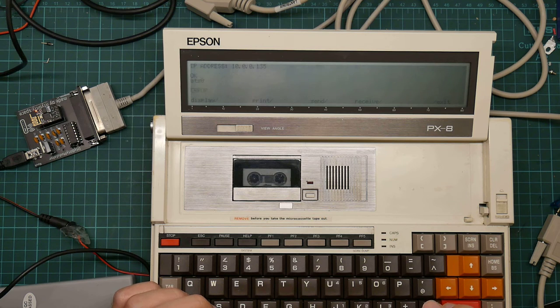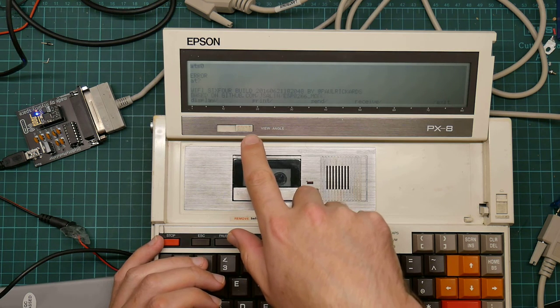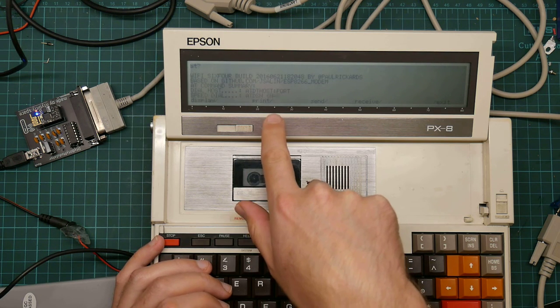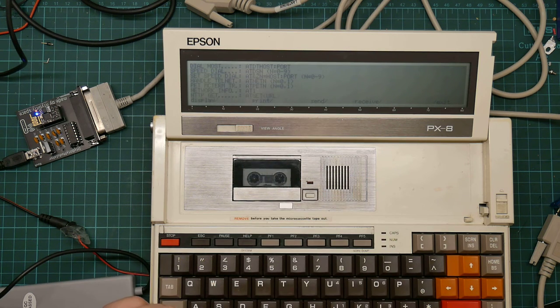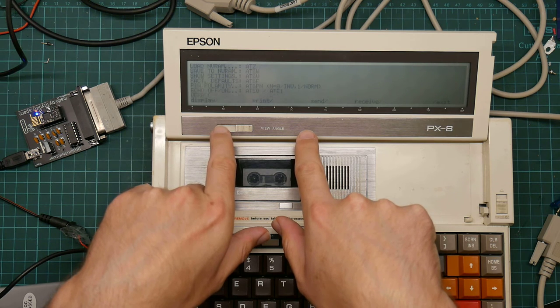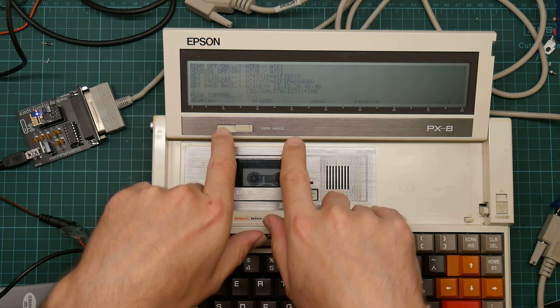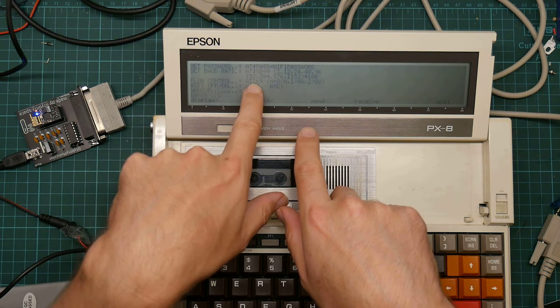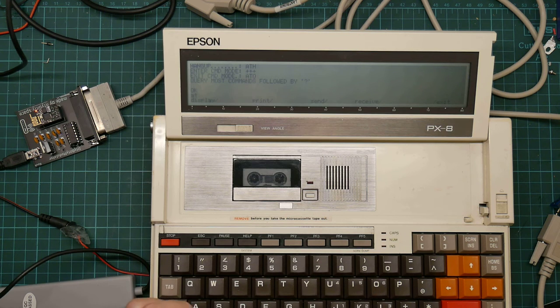ATDS0? No. Help again. You can increase the baud rate, which will improve things no end. ATDS0, that's the one I want. Does Control-C work? No, it doesn't. Right now it's set to 300 baud, which is the default and pretty slow. Yeah, that command, AT$SB, changes the baud rate. But I'm not going to do that just yet. Dial speed 0.